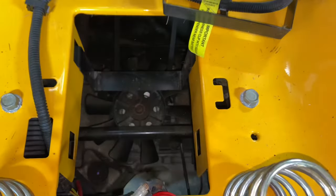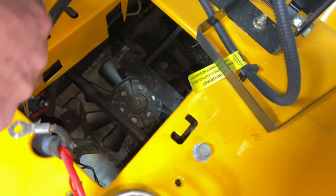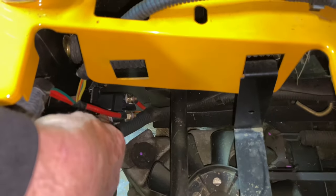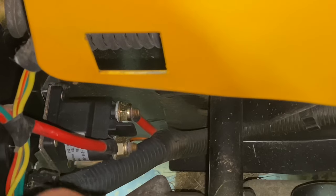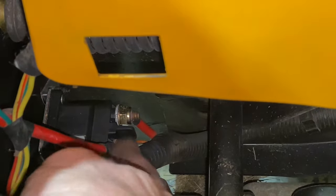If you need to take this other one out — now I'm going to use a flashlight. I don't know if it's going to help you or not, but the starter solenoid is way down yonder. Right here is the starter solenoid — that is the location. You see there's two studs, positive and positive. That is the starter solenoid. Since you now have the battery out, we have no 12 volts going to the starter at all.